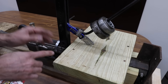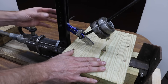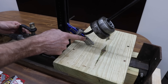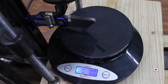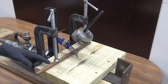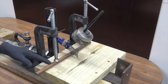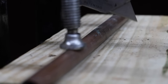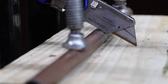In order to provide a fair and standardized test, I built this piece of test equipment. The assembly is on a slide in a fixed position — as I slide it back, it drags the blade across a fixed object. I can easily swap out blades, and I'm going to use a set amount of weight, just a little over two pounds of downward force. Utility blades are sometimes used to remove insulation off copper wire, so I'm going to drag these blades across copper pipe three times to see what kind of impact it has on the blade.